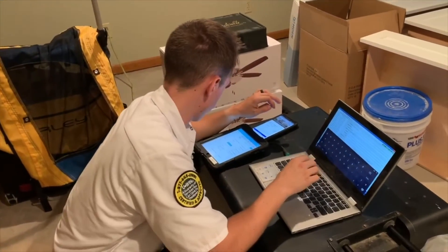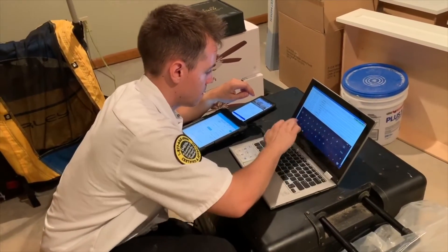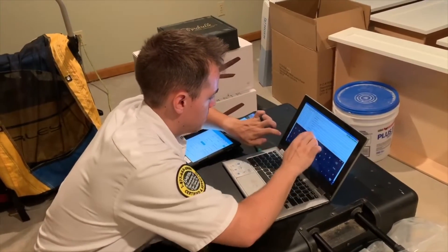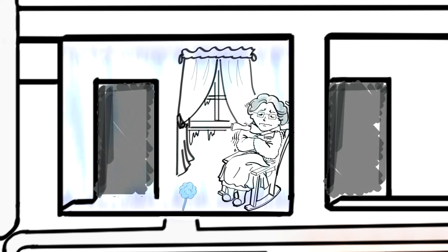The most popular size equipment is a three-ton air conditioner, and if you think 30 percent leakage, we're leaking an entire ton of air conditioning — one ton of it is leaking whenever that three-ton air conditioner is operating. So we're leaking 30 percent — where is it going? It's not being lost, but let's say we don't know where it's going. It's not going where it's supposed to go. That's what makes certain rooms freezing and certain rooms not so great.